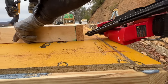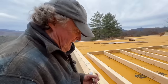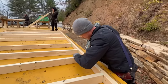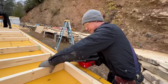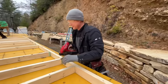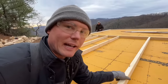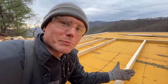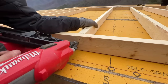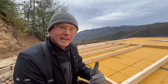Now we're building it. Three nails. We'll go two in that one. Something with this nailing — it's actually good to angle the nails a little bit if you can, opposing each other. It just gives it extra grip. Alternating angle actually kind of binds them up so it can't pull straight out.